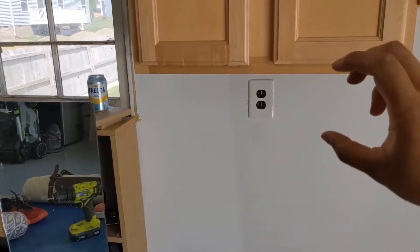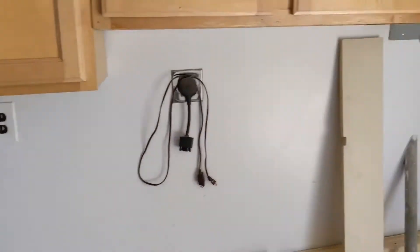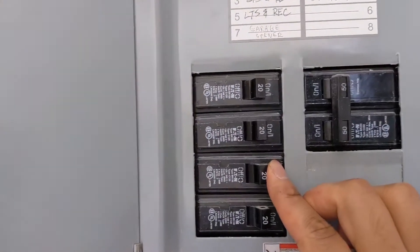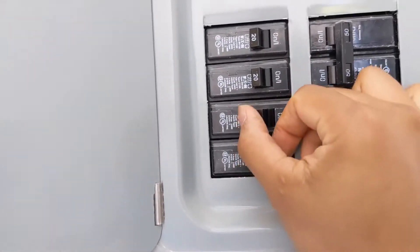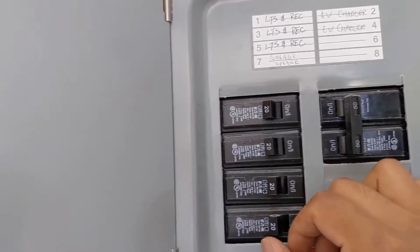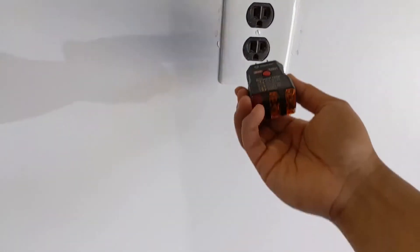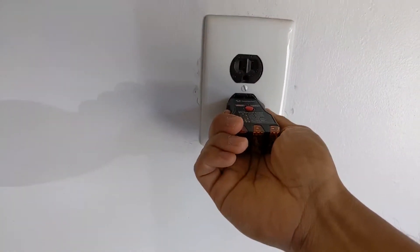So I'm in my garage, and this is the outlet that I'm drawing power from that's going down through that conduit. You can see here that I've got 20-amp breakers. I'll just turn them all off — one of them is to my mini fridge, but I think it'll be okay. I've turned off all the breakers and I'm using my receptacle checker to make sure it's not on. I don't see any light, so it's good.